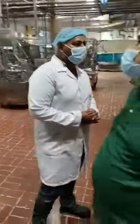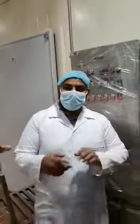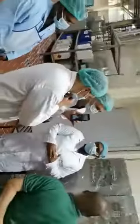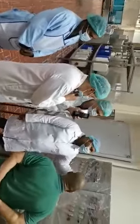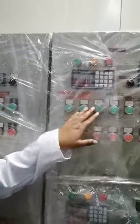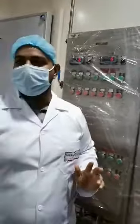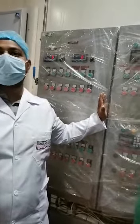First, coming to the point of the skim, we have the blending area. First we have to do CIP, then after that in the blending area we have to mix all the whole raw materials. After mixing all the materials, we have to mix in the water and the butter oil. Then we use the mixing controls — the buttons and all things. After finishing the whole process for the raw materials, the last step is pasteurization.